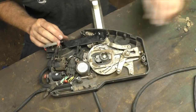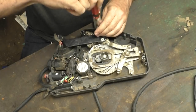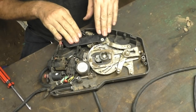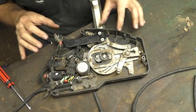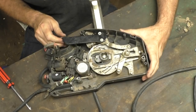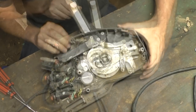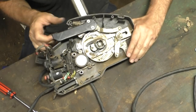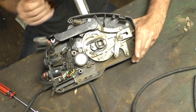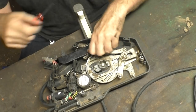On the top here where we had our fast idle, I'll just pop this back quickly. Now we've got the cover off. These do vary slightly from model to model. In the case of Yamaha outboards, this fast idle comes off with the back cover, so it actually makes it a little bit trickier to get the mechanism all lined up again when you drop the back cover back on. But if we lift this fast idle, we've just got a really direct mechanism to move the throttle cable here. You can also see it's got a return spring for the fast idle, so once you get up to high speed it sort of locks past a cam, but once you drop it a little bit it'll help it return.